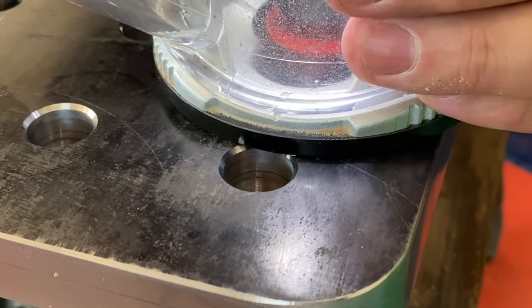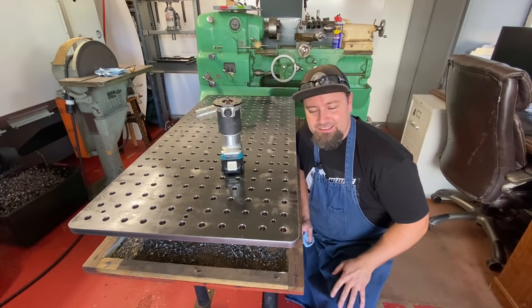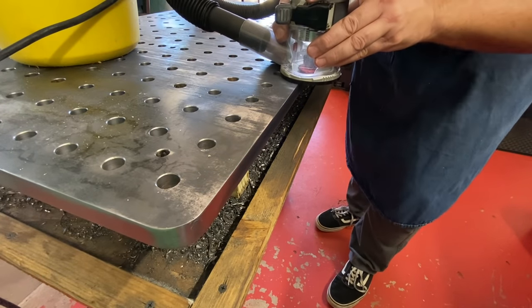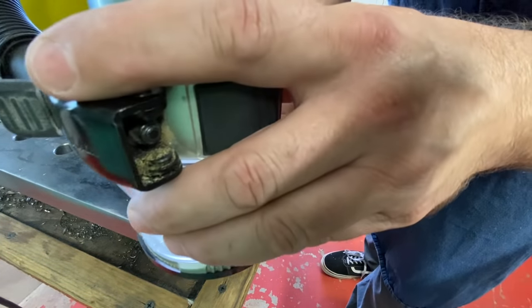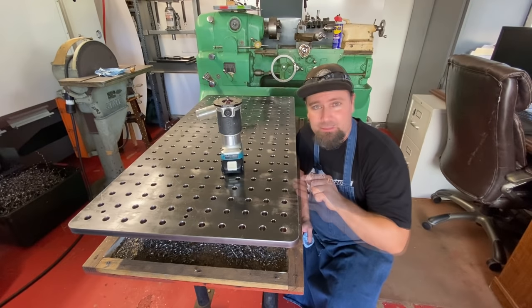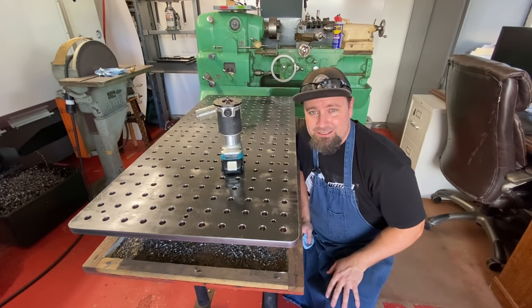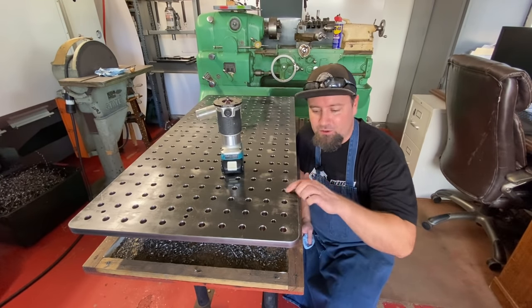Now, when it came to the outside edge, everything started off pretty good, but then I started noticing an inconsistent edge. And that's because the sides are not perfectly square with the face. That was a failure on my part not to make sure that these were really dang square. So I went back and tried to adjust the depth on the shallower chamfers and it was really hard to get it to blend right. So I ended up having to file a couple of areas. So the outside corner doesn't look perfectly machined, but the corner is broken and it looks good. But the holes are just unbelievable.